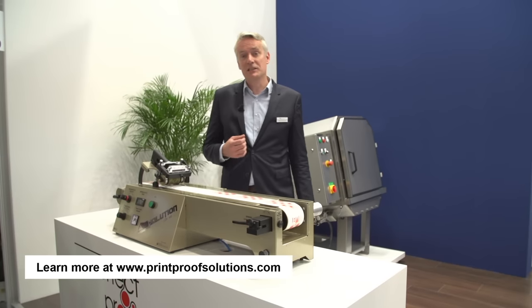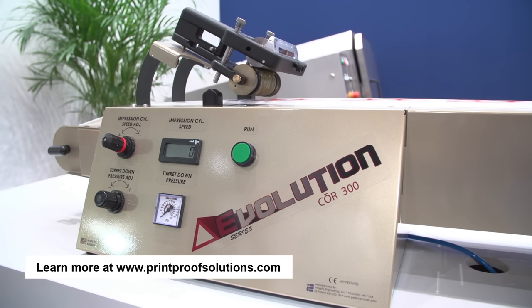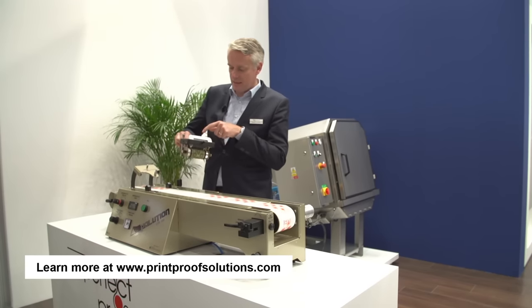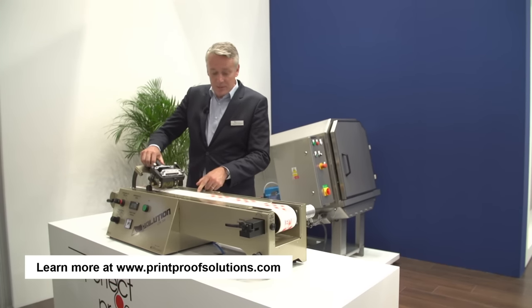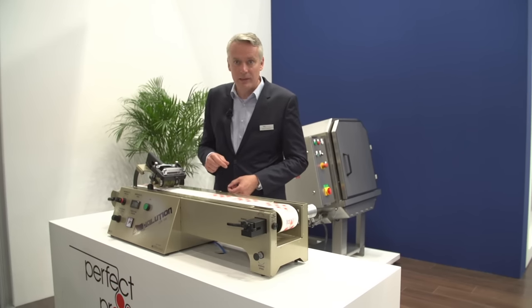Printproof Solutions is the distributor of the perfect proofer. It's proofing equipment made in the USA, and we are the distributor here in Europe. With the proofer, we simulate the flexo printing process. So it will have the same printing plate and the same anilox roll, same sticky back, same substrate, and the same inks, of course, that you will experience on press. And even the same dot gain can be achieved.